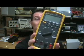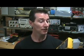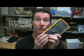Since I developed this little project, I've lost count of the number of people who have been baffled that their multimeter — even a precision Fluke 87 multimeter that they've been using for 20 years — is in many cases useless at measuring precision current, be it in DC or AC circuits. And it's to do with burden voltage. Most people know about burden voltage. There's a shunt resistor inside the multimeter that drops the voltage when you pass current through it.